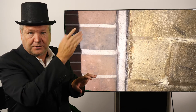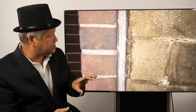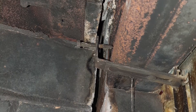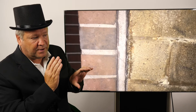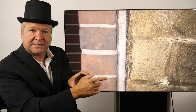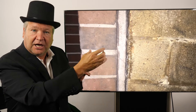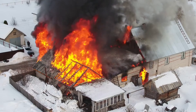You get deteriorated mortar joints on the profile seam, and next thing you know this mortar joint starts falling out and you get a fire hazard, because the heat transfer can go in between the fireplace itself and the front wall — and on the other side is your timber stud wall. That timber stud wall can heat up and next thing you know you have a house fire.